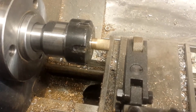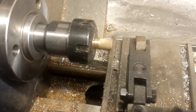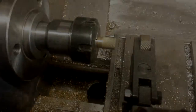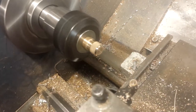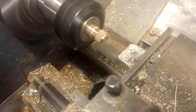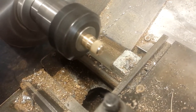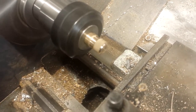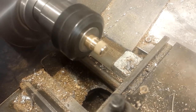Maybe there's room for improvement but I think it's good enough. I'm using a nice little round-nosed form tool just to sculpt this a little bit — coming on quite nicely, just playing and not to any particular design, just until it looks nice. It will be drilled and threaded M4 so that it can screw onto the stud.